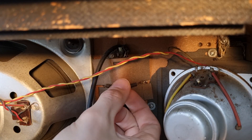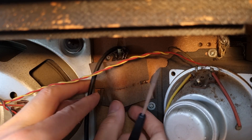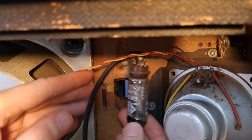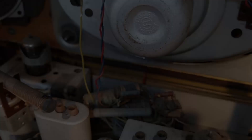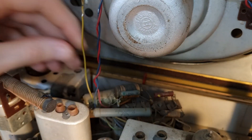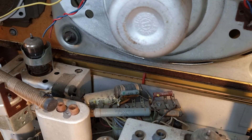The magic eye should just be clipped on with a spring. It's still an original Telefunken EM80 — no idea if it's still good. These are the speaker wire connections on the output transformer. I'm just going to clip them off, leaving a millimeter or so of wire so I can easily find back the coloring. The chassis should now be loose and come out of the radio.